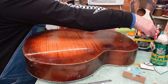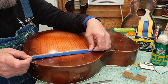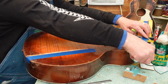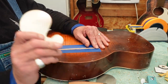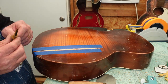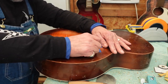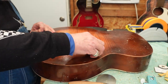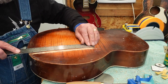We need to level this out and get it smooth. We're going to take this soft scraper here and get close to the edge where the glue is and clean that off. We'll mask this off again, give us a little bit of the width of tape to protect what's left to the top of this thing. I like these round scrapers because you can vary the area you're working on easily. We're starting to get through, then I've got 1500 grit sandpaper going along to make sure everything is nice and smooth.